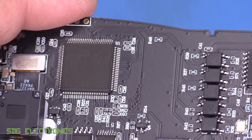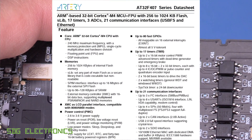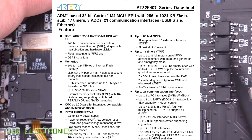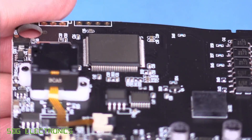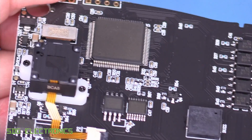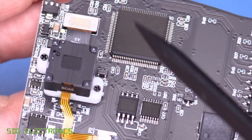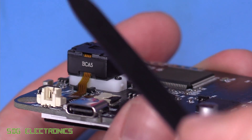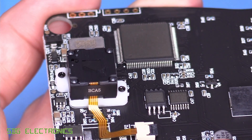I think I caught a glimpse of some markings that weren't fully lasered off — does that say Artery on the microcontroller? Not a brand I'm familiar with, but it's probably just a generic STM32-class processor driving the TFT, interfacing with the thermal camera module, flash, and beeper. There's a shutter on the camera controlled via a flex connector, with image data coming off a separate connector. The only marking on the thermal camera is BCA5 — it stands off from the PCB with a little viewfinder on the back of the multimeter.